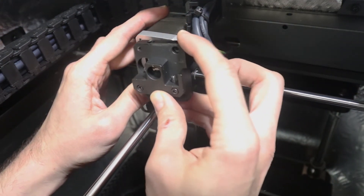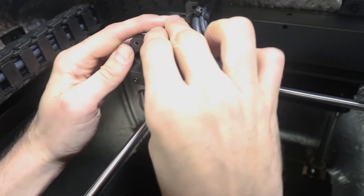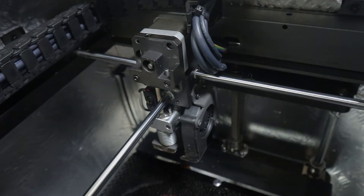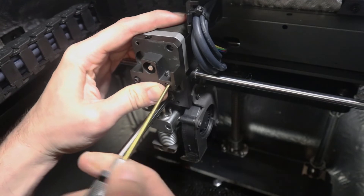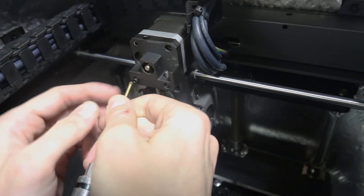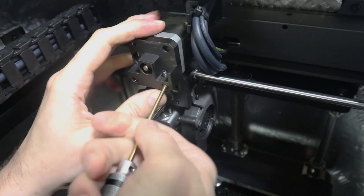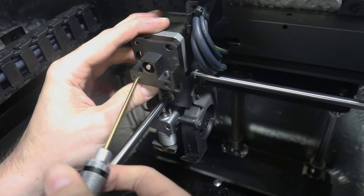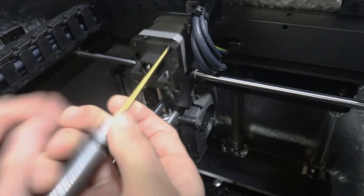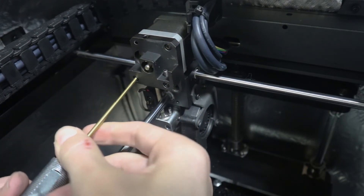Make sure the PTFE tube goes down into the hot end, at least so it can be aligned. Get the 2.5 millimeter and attach the face plate to the motor first. Bring the face plate back in by screwing in the two bottom screws as before. Don't go too tight on these until you get all three in — you don't want to strip anything, this is made of aluminum. Loosen everything just a half turn, then take that third bolt from the face plate and line it in. Tighten everything down nice and good.